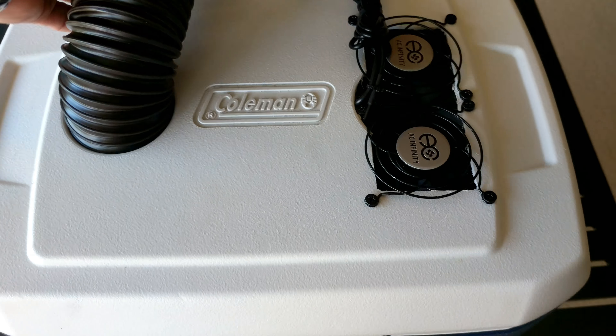I've been running the new version here for about an hour now — this is when I'd start to see problems with humidity build-up on the coils. As you can see, we're still getting right around 50 degrees on the discharge, and it's about 89 degrees outside, so we're getting a good almost 40-degree differential. We are pulling 5.1 volts at about 0.5 amps, 500 milliamps, and it's been pretty consistent throughout the entire test.